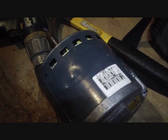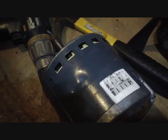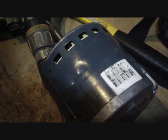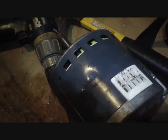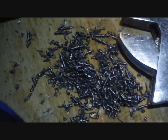Here's our X13 motor all separated. What a pain — it wouldn't come out with the blade puller. It was so fused to that blower wheel I had to drill it out to get it out, which is a last resort and hellacious. There you go — there's some blower shaft left behind.